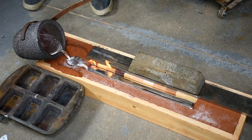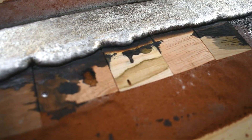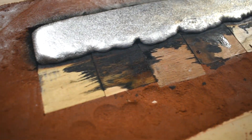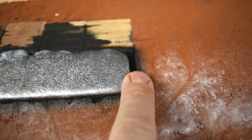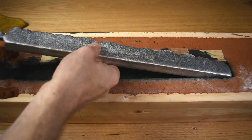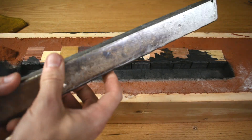Predictably there was lots of fire, but not as much as I thought. That charred line going through the middle is not very thick — seems like aluminum can be handled pretty well. I also didn't expect all the oils coming out of a lot of this wood; some potentially wasn't dry enough. But some of the other pieces I've literally had kicking around for longer than I've been married and moved my scrap pile several times. First thing to look at — look at that shrinkage. That is quite a gap. Aluminum has the worst shrinkage rate, but it's the first casting video I've done where the casting itself is secondary.